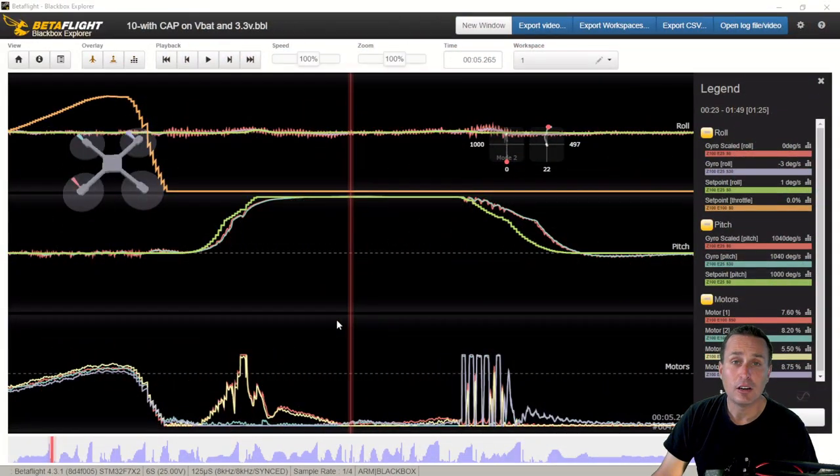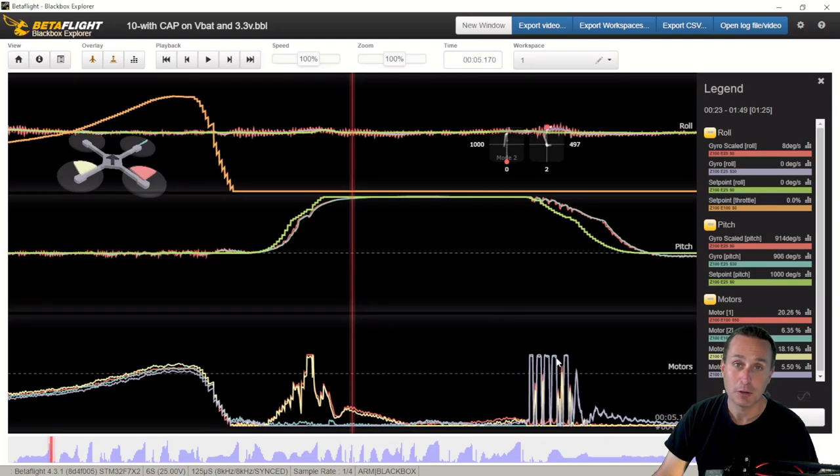So this is the log of that flight, and you can see on my pitch axis when I'm doing a forward pitch move that I do not see all the jumpy noise except for the very end here. You can still see some spikes when the flight controller is commanding the motors to 100% to arrest the move, which is basically the most stress that they get because of your super rates and how that works. You're going from full rate flip forward to saying go to zero pretty quickly, and your flight controller demands 100% of your motors, which you can see is throwing off some electrical noise that's impacting the gyro signal up here and then causing the motors to have some spikes, as you see right there.